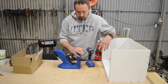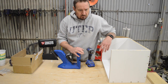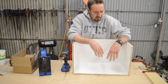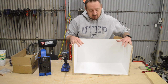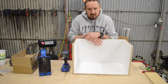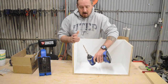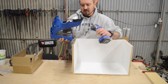The first issue is that it's quite bulky compared to the K4. If you remember to do everything in the right order — pocket hole everything before final assembly — it's not a terribly big deal. But I have these cabinets where I always forget to put the pocket holes in the sides and back of the carcasses to hold what will be the top of this dog feeding station. What I have to do is run the pocket holes after it's assembled. With the K4, I could slip it on and pocket hole the side and back, but with this new jig it's so big and bulky that it complicates the whole process.